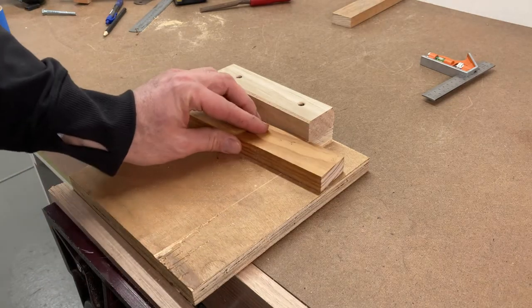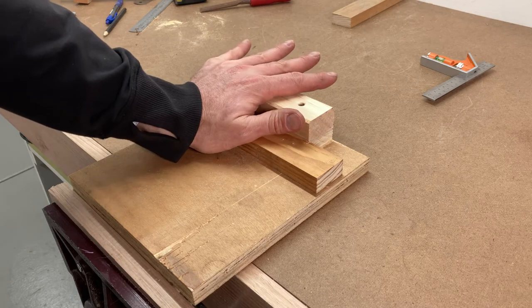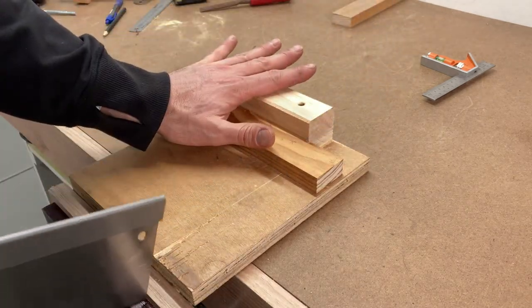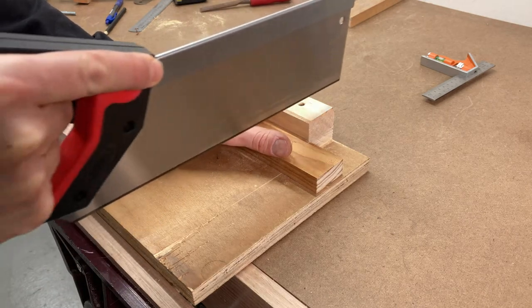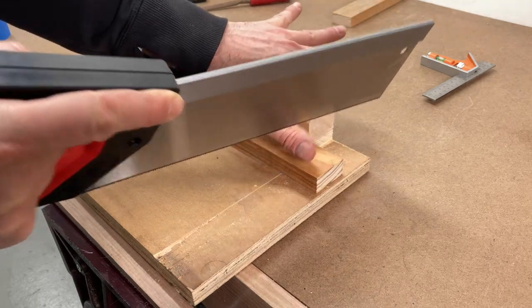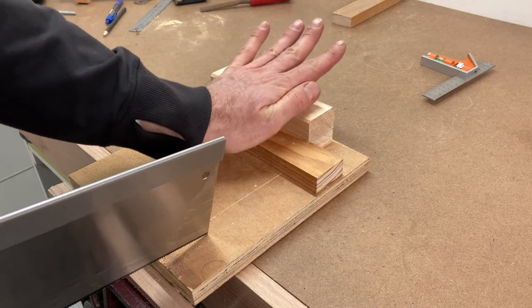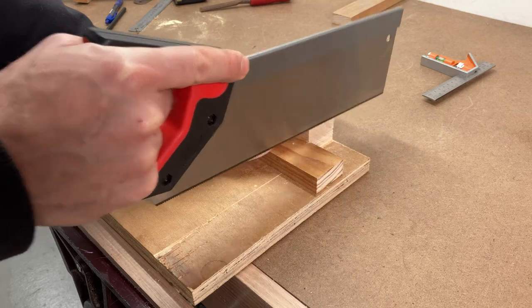Students will often place a piece of timber in the bench hook and then use this thumb-out grip. That's because it feels natural to do so. But as you can see, your thumb is just inviting trouble. By placing your thumb at 90 degrees to the blade you significantly increase the risk. A better method is to keep your thumb and fingers in the line of the blade — that way if you come loose you'll run along your fingers rather than across them.